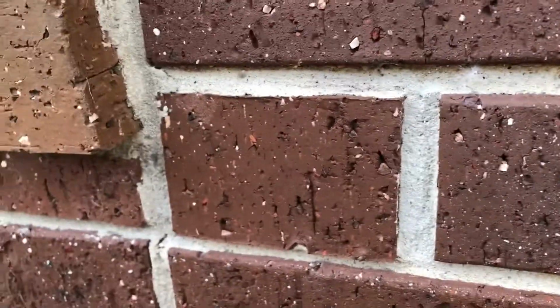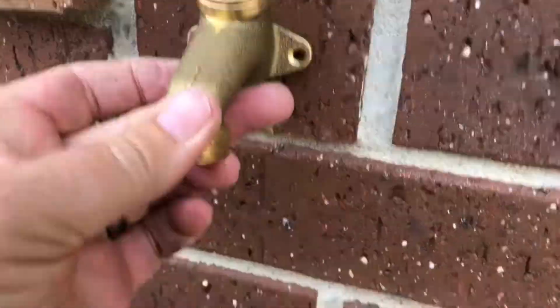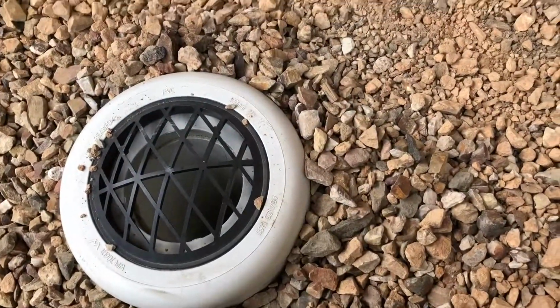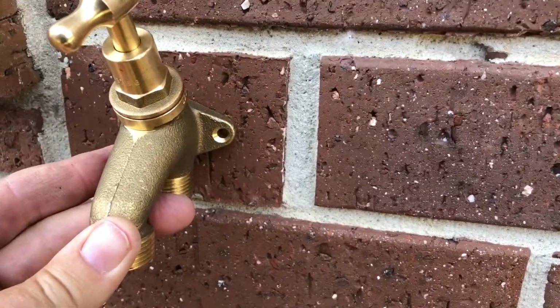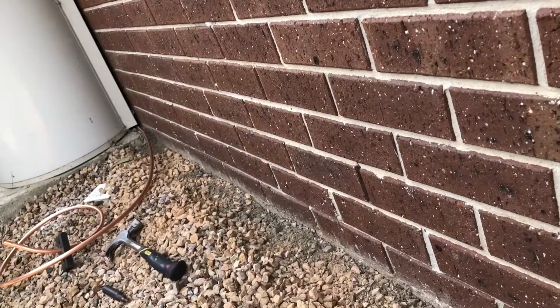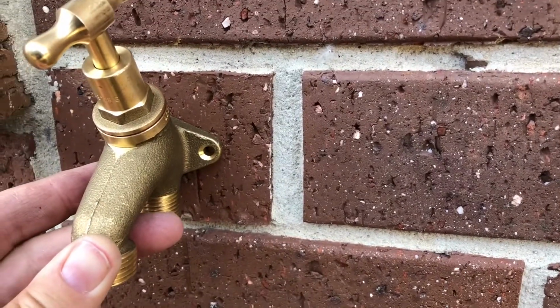So that's how we're going to connect the pipe up to the tap. And the tap, we've chosen this half brick here. We're going to mount him right there. We've got a drain here in a beautiful convenient location. So that's where our tap's going to be. So copper pipe down, we're going to run it along just against the house there. Through, and when it connects, that'll bring that cold water down, and we'll have ourselves an outside tap.